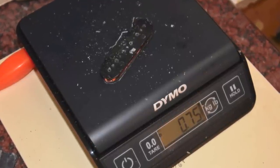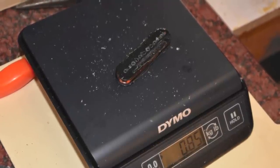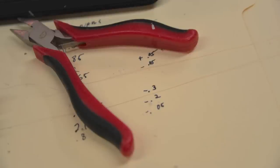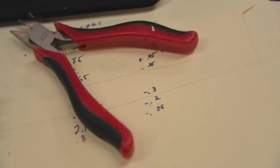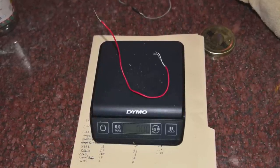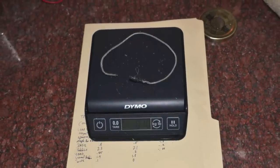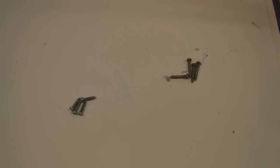The Gibson bobbin is heavier than the Chinese bobbin. Two reasons could be: Gibson is using better quality copper wire, or they actually have more physical windings — though the windings looked similar in number and the wire thickness appears to be about the same, roughly 42 AWG Formvar wire. I'm assuming the Gibson wire is of higher quality and made in America. The Chinese connection wire doesn't register a reading on the scale, while the Gibson one does — definitely higher quality material.